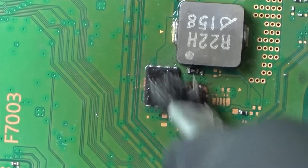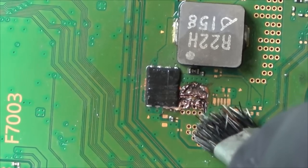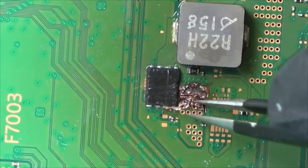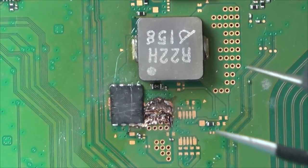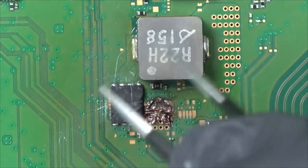Do you know what's just crossed my mind? I wonder whether they did the work of separating here. Because look, that chip's not burnt, is it? It looks like it's this area here that's burnt. So do you reckon a capacitor failed really bad and blew up? And they've separated out the short, but they didn't bother connecting up. Do you remember these bits down here were not connected up? This wasn't connected for the power button and this wasn't connected. Do you reckon they did the work but then thought, we'll get more out of the customer? Not in a bad way. Obviously they can't be doing all this work for £30. But maybe the customer said no and they just didn't bother connecting it up again. Maybe the work had already been done.